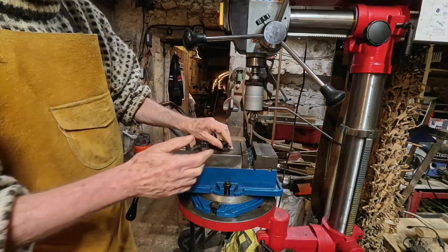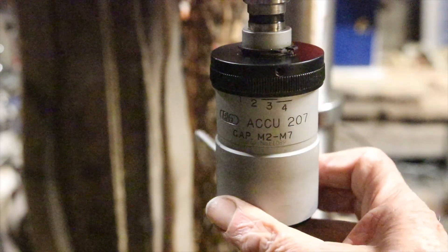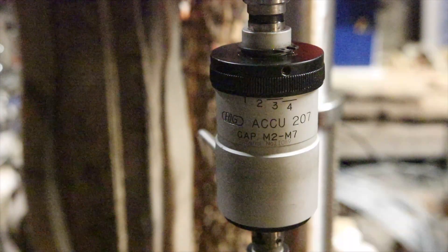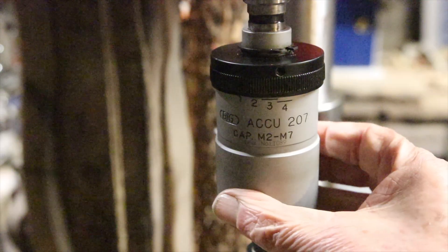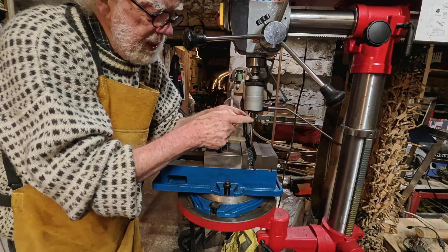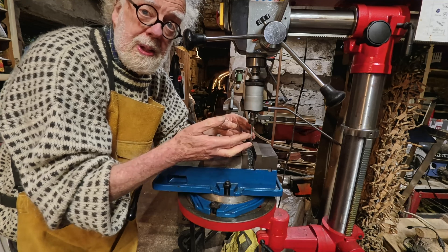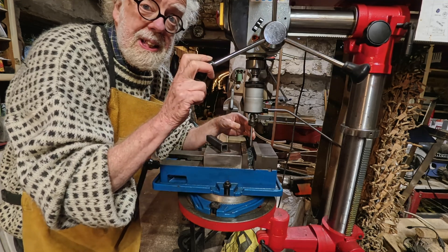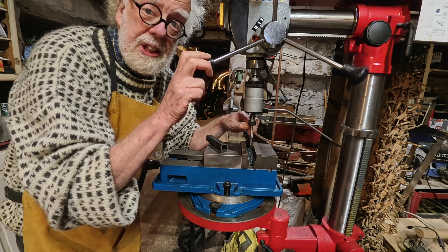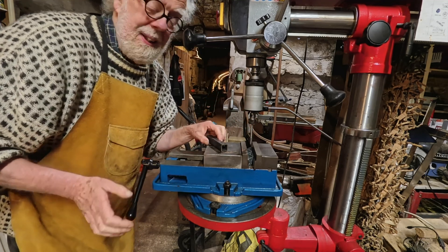Come and see it — here it is. It's a gearbox with a torque adjustment on the top and a bar which rotates. Inside, you can adjust the torque of cutting the tap. It also slows the speed down, increasing the torque, which is adjustable. You put the tap in the bottom. When the tap either bottoms out in a blind hole or you stop moving the drill press down, it automatically reverses, takes off the torque, and brings the tap back up in one move. It is magic.